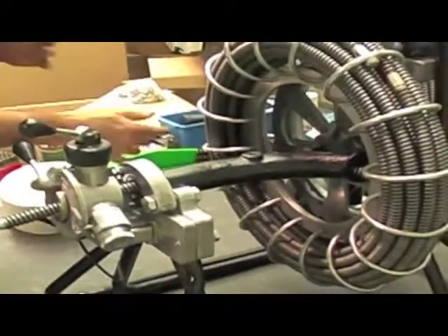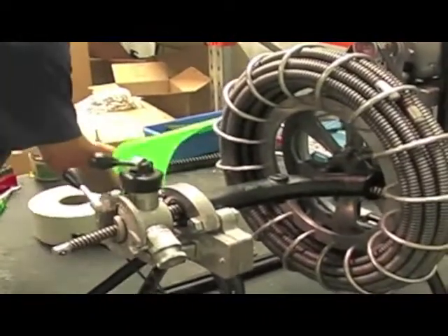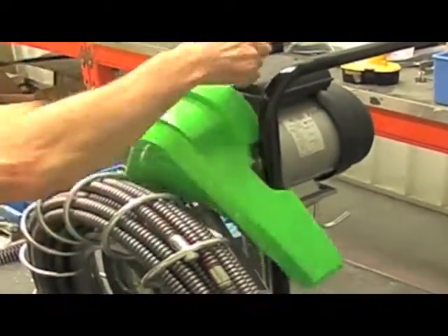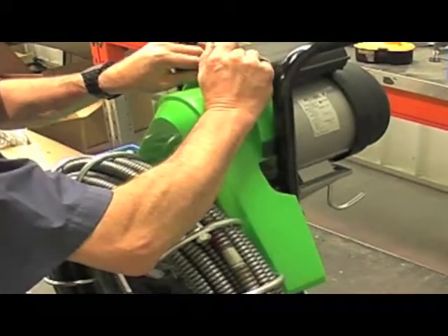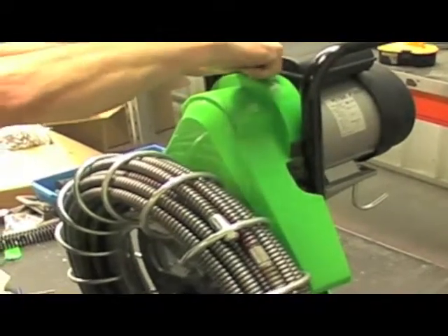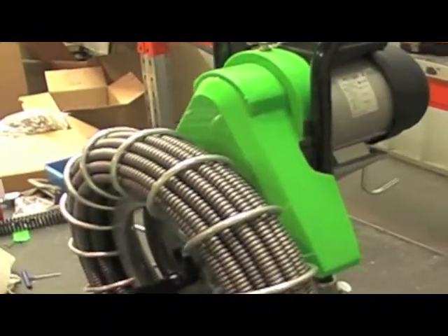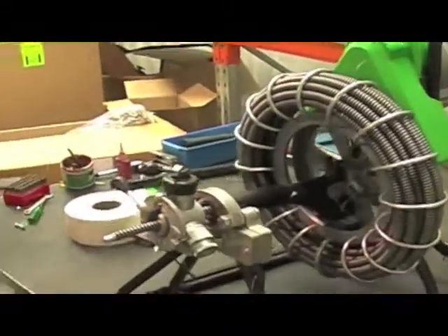And that is about it at this stage. You put your pulley guard cover on. Always have your pulley guard on for OH&S — you don't want to get your fingers caught with the fan. Just clip that down. It's only got a little screw nut thing on it. Realign it so it clears the drum — it's got two little rubber tangs there so it clears the drum and it's free. And then the last thing you'll do is just roll the splash cover around and refit your splash cover. And that's about it.